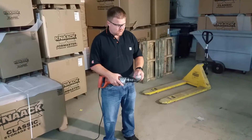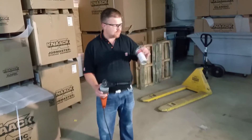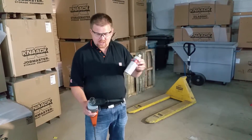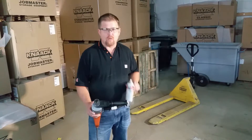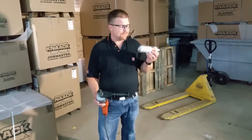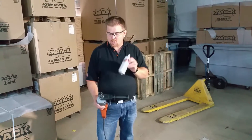When you're drilling steel, you should always have some lubrication. It comes with a bottle — this one's a little beat up, it's been in my kit for a while — a bottle of lubrication to keep the bit lubricated all the way through the hole. You don't need to apply it while you're drilling. That's the beauty of this stuff — it keeps the cutter coated all the way through.